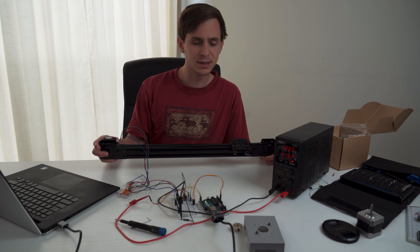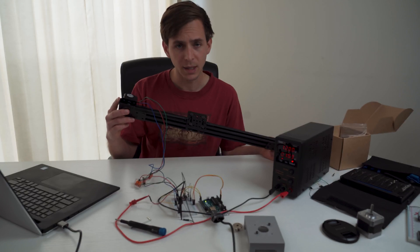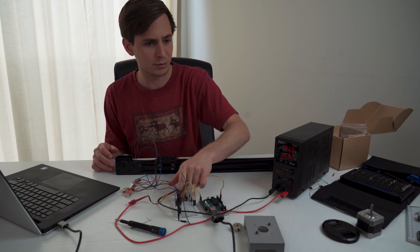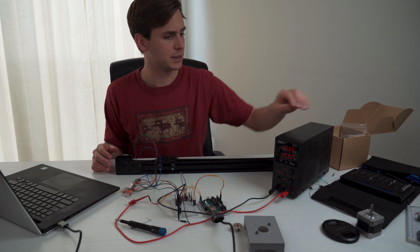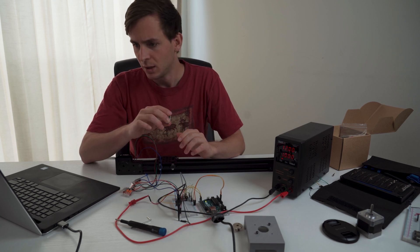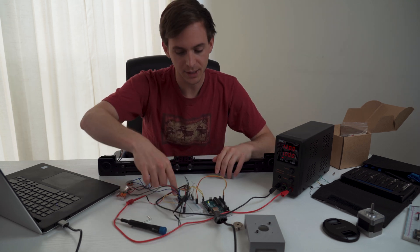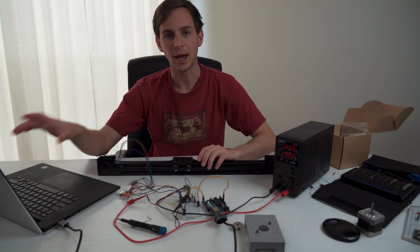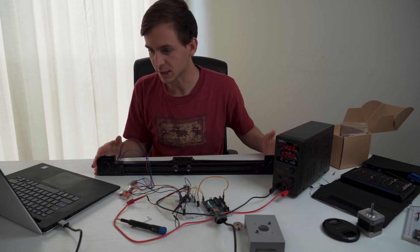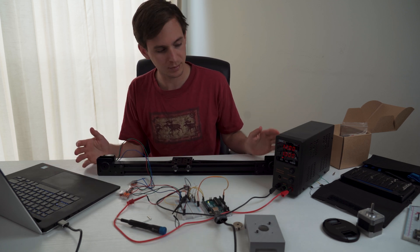Just imagine you have your nice cinematic shot and you just hear this — yeah, that's not going to work. I think I might have a fix: I have a different stepper motor driver that is supposed to be silent — it is a TMC2208. I don't know if the code is going to be different, but I'm just going to try to install that right now. I came across that the TMC2208 has Arduino libraries built in, so I downloaded the library, uploaded the sketch, and modified it just a bit so we can go left and right.